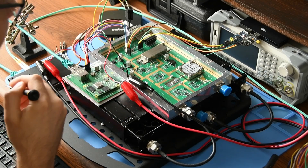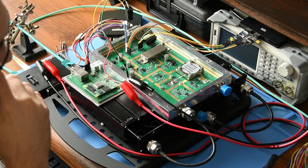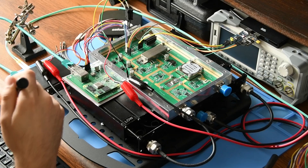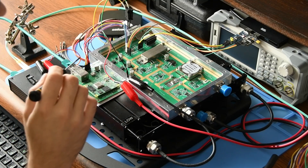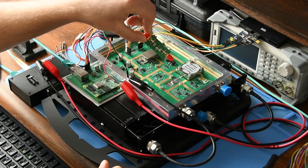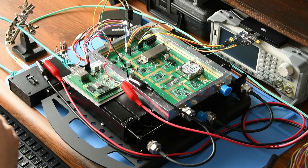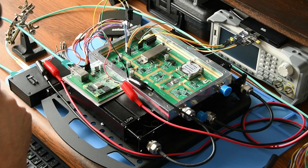What we see here is revision B of the device, and I'm already working on revision C, which is going to have quite a few improvements — including a low-pass filter right where the power amplifier section is. We've got a strip line here that just passes RF power from the RF amplifier to the circulator. I have decided to put the low-pass filter right there. This is the prototype of it: it consists of two air coils and three capacitors, and it's able to get the second harmonic down to minus 70 dBc below the carrier. That's going to be added to revision C.